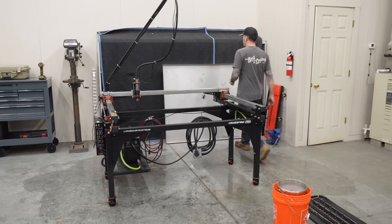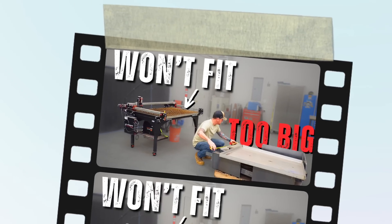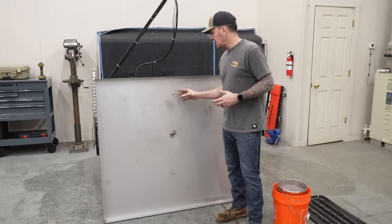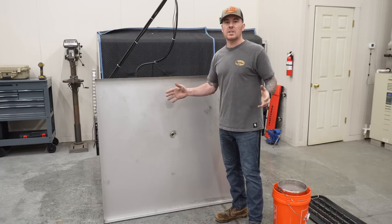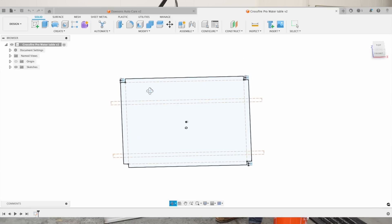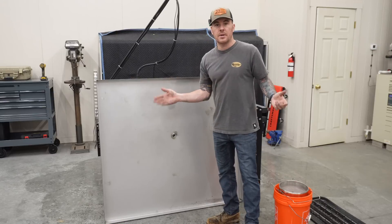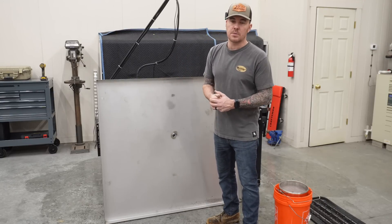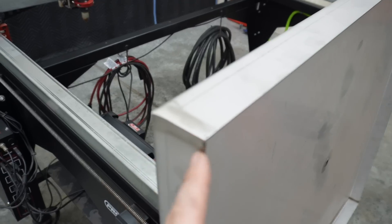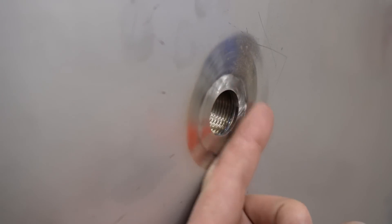Now let's take a look at this new water table. I had a video a couple weeks ago where I talked about how I get my larger fabrication jobs done because a project like this isn't going to fit on my plasma table — it's too big. So I subbed it out to a larger facility. I created this file on Fusion 360, sent them the file, they fabricated it, got it all welded up, and I went and picked it up. This table is 14-gauge stainless steel. The corners have been TIG welded and ground down nice and smooth. Most importantly, it is all one piece. Right here you can see the drain — it is flush, there's no lip — and this is a one inch hole with threads behind it.